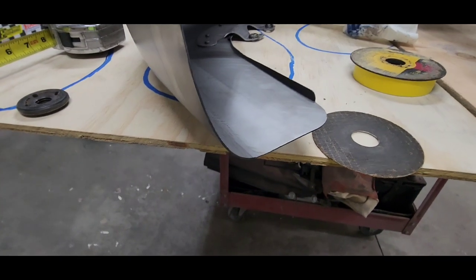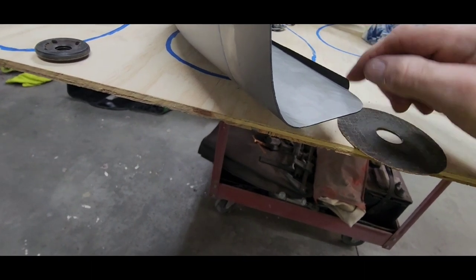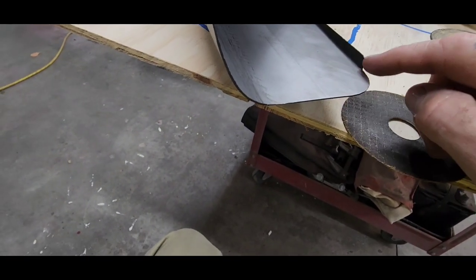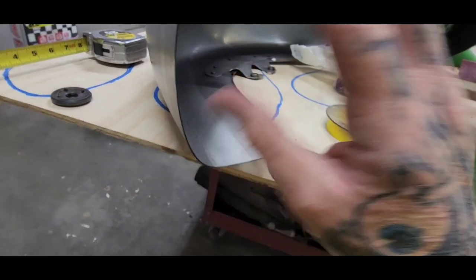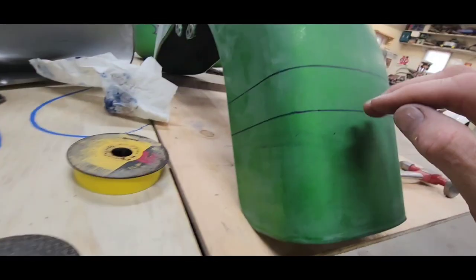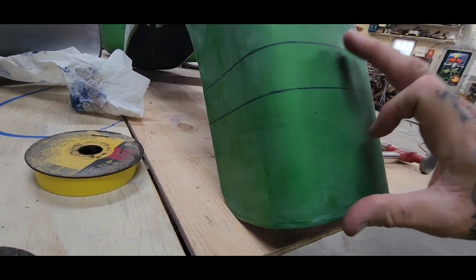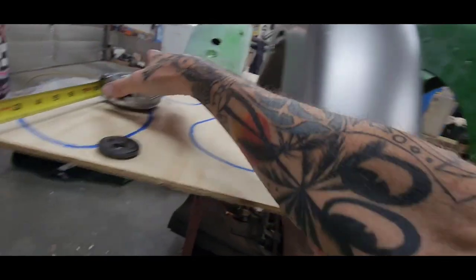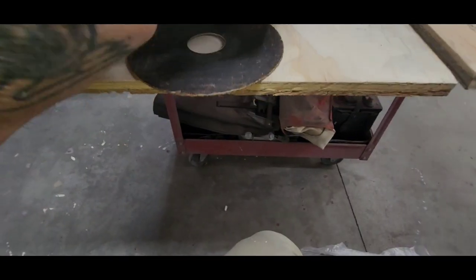So when I'm stretching a Harley fender, particularly a front fender, I like to cut it up past this flange because they have a rounded edge here, and then you have a contour, a rounded edge here, and you don't want to try and just scab something on to the base of this because you'll have a gap. So I cut this off, and then I'll take however long I want to stretch it off of the donor fender. In this case, I'm going to take off 2 inches off of this one. That'll get me into that flange there.